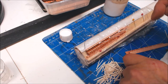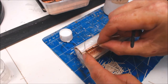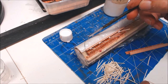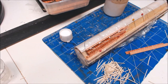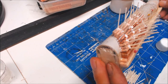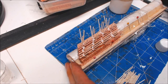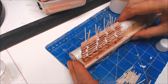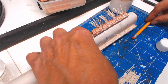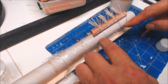Just put them in - this also binds the back half to the back of the other brick, so it does strengthen it up. I'll carry on and get to the top. I've reached the top - it looks a bit of a mess, a bit like a hedgehog, but by using those spacers you can see the brickwork coming up to the top point with the brick standing on its edge. It's opened the bricks up and allowed it to curl round. All you do then is turn it round and start exactly the same again on the other side.